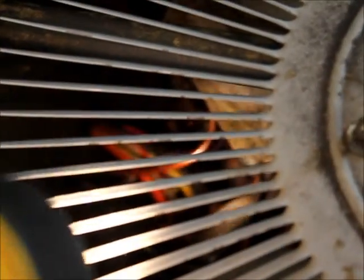Take a look inside before you start this thing. That brown wire looks like it's going to get hit by the blade. Now those wires come off of the fan. So what you need to do is take the side panel off again. It's no big deal, just 4 screws. Alright, you're going to come down here to where the fan comes in, the brown wire, and you're going to pull that through some.